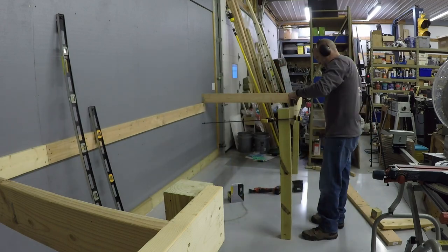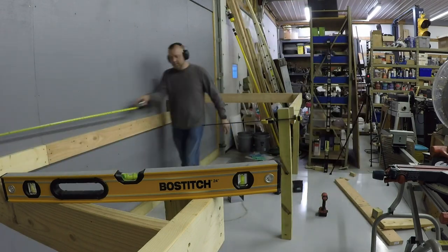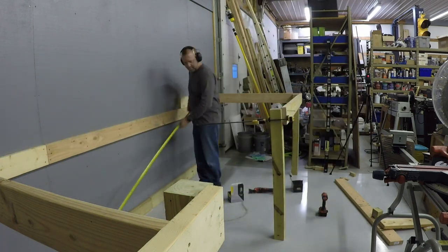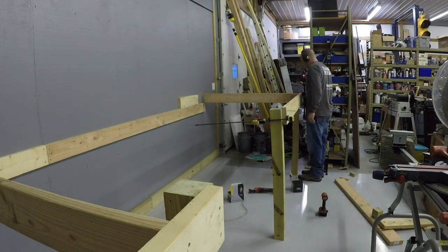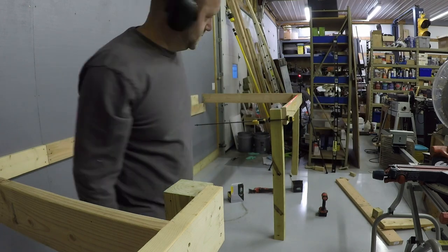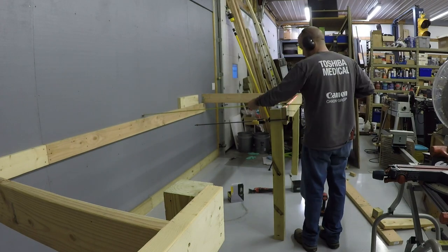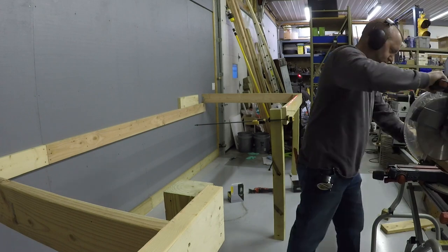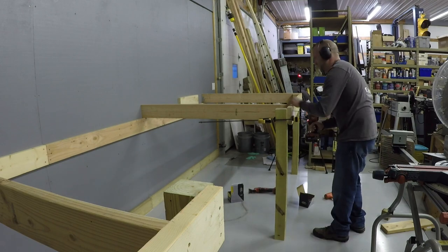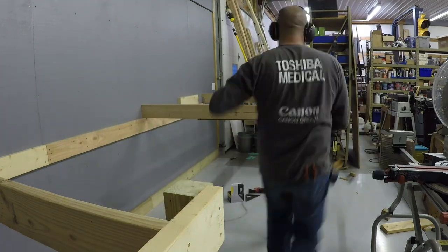You will see me constantly checking everything as I go. I don't want to assume that I'm level and that everything will meet up properly — if something is out of alignment or isn't level, I want to catch it early. I'm going to use the same laser as before and shoot a straight line down the front edge of the mezzanine. A shop wall is never perfect and always has a little bit of a wave to it. I'm using this to ensure the front edge of the mezzanine is straight and will measure from this to the wall and cut each joist to their respective length.